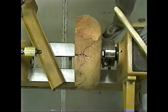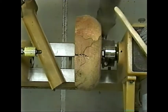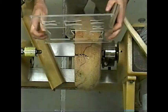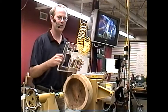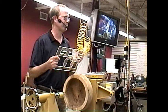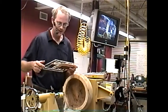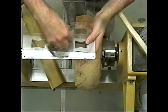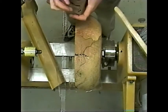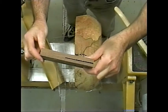I've got this little Porter Cable handheld router because I can do this kind of thing with it. To make the bow tie itself, you just take a plunge router. I got one of these templates at Woodcraft, but you can make your own. You don't have to have this particular shape — I make turtles, dolphins, fish, whatever you want. Clamp this to the piece of wood, take your router with the inlay kit, and route out the outline.